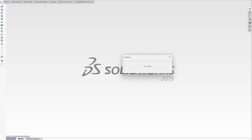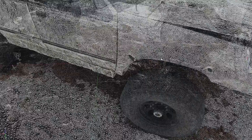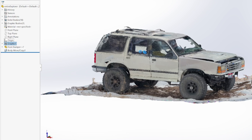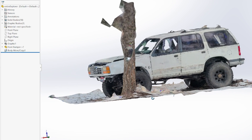The problem with a textured mesh though is that if you want to pull it into Fusion or SolidWorks or whatever 3D CAD program, they often don't play nice with them and you'll just lose your color entirely. That's why this step is optional. Rather than doing a textured mesh, you can just leave it as a normal colored mesh. All that's left is exporting the model as a 3D object. My advice is that you import it into CAD as a graphics model. If you try to import it as an actual parametric object, there can be tens of thousands or hundreds of thousands of vertices on the scan and it will not play nice with your CAD software. But that's okay because as we discussed earlier, you don't need a parametric object, you don't need precise dimensions, you only need a visual reference. So a graphic object will do just fine.